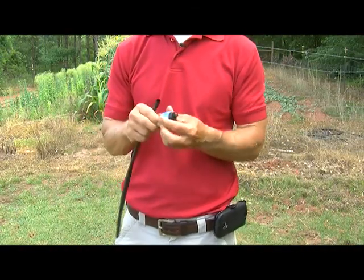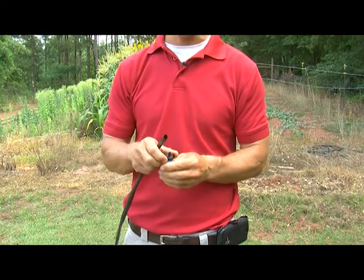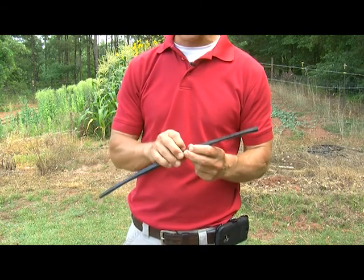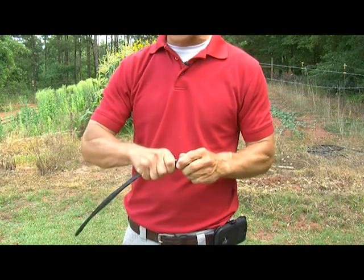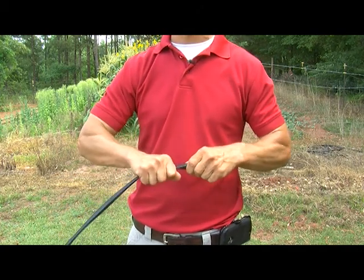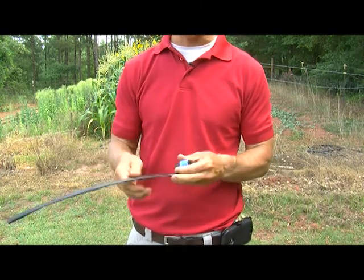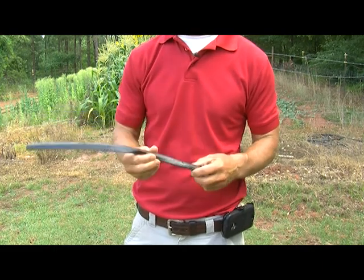Talking about the drip irrigation — this is the fitting I was describing. You have a tool that pokes a hole in your five-eighths or three-quarter-inch poly tubing, and this just snaps right in. A little nipple holds it in place. Then you take your drip tape — it comes in different configurations: holes every eight inches, every twelve, different flow rates, pressure-compensated or not. You just slide it on and screw it down. Every year when you need to till, you can unhook this, leave your main line in place, drag the drip tape out, do your tillage, then pop it back in. Very simple, very efficient.